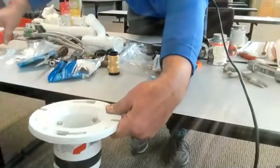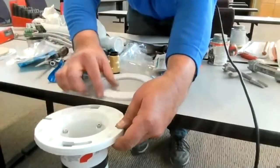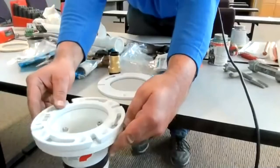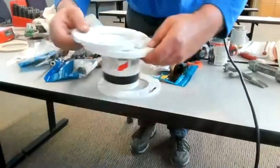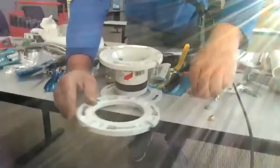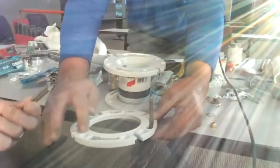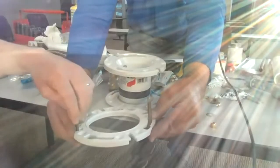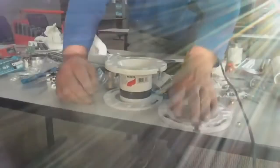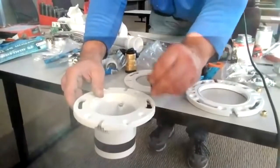So now that it's flush, I brought some closet collars — this one's a little thinner, you can put that on top and screw it down. If it's really low, I've got a thicker one. I always put caulk in here, caulk it down and then screw it down to bring it back up to where it should be. Use the slidable where you put the bolt. Make sure your flange is on top of your floor, and then you can put your bolt in and set the toilet.